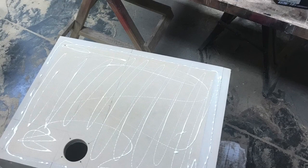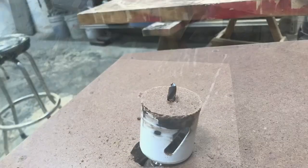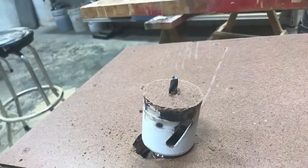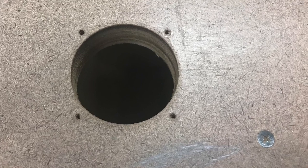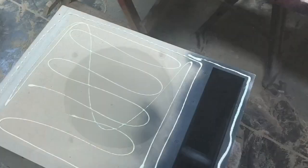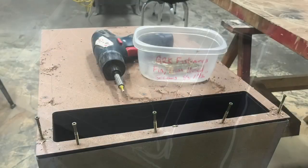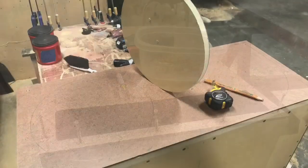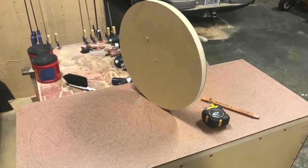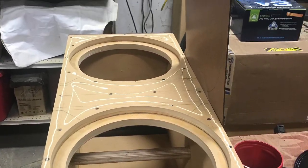Now I can get ready to start adding these quarter-inch hardboard pieces on. Glue coverage, space screws accordingly. I had to drill through the inside out of that speaker terminal. The port side is next. I like using these smaller head star screws — these GRK fasteners — when I'm working with thin material or thin edges. Just pre-marking so I wouldn't cut too much or glue too much on that hardboard. Everything pre-drilled, step-up bit.